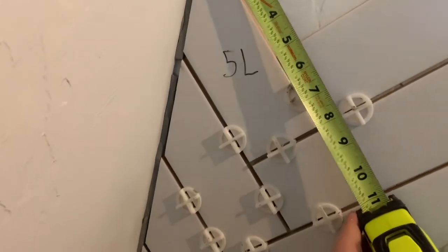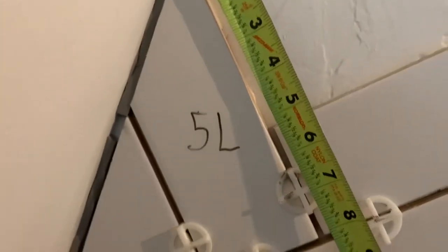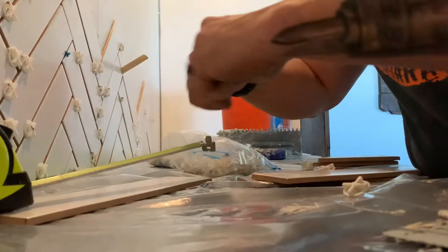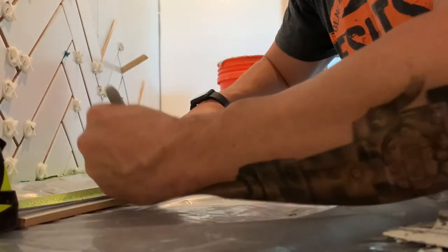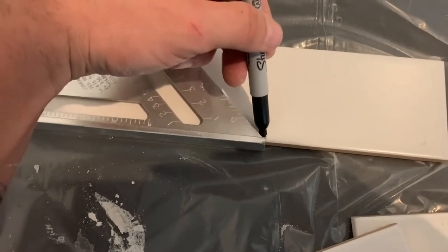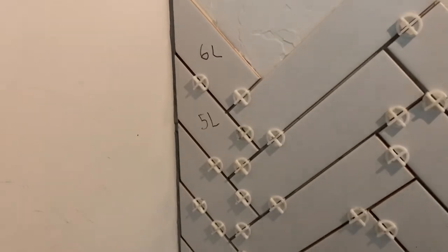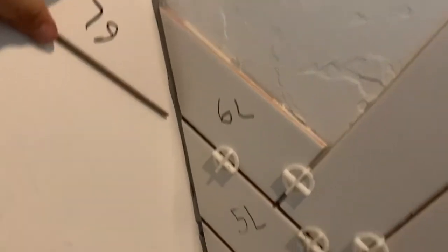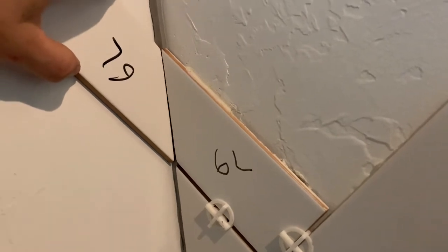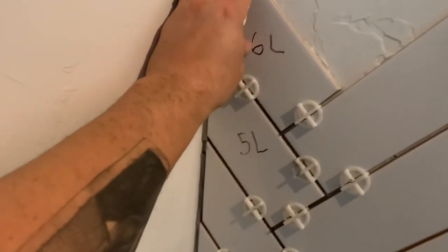They should all be about the same cuts — maybe just a quarter inch difference depending on how accurate you are. I measure in from the inside for the inside corner piece — it came out to five and a quarter inches. I take my speed square, slap it on there, and measure it just like that. They're all 45-degree cuts — the speed square is your best friend. If you didn't have the corner spacer in back there, these pieces would not line up like this.